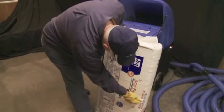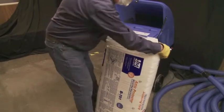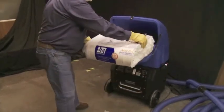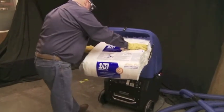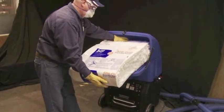Cut your bag of material in half. For safety purposes, keep all foreign materials out of the hopper — this includes tools, sticks, and any object other than the insulation. Foreign materials may damage the machine and cause serious injury. Load the insulation by gently pushing it forward into the hopper. Caution: do not let the plastic bag enter the hopper.